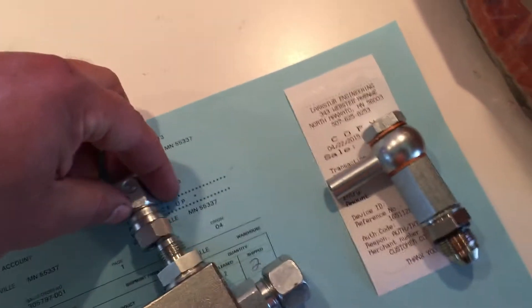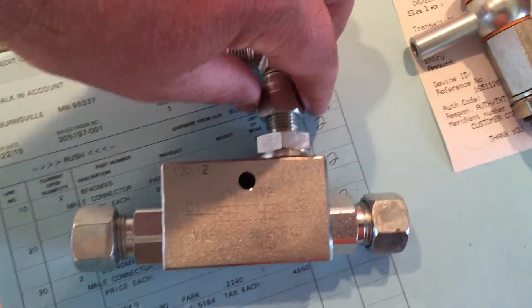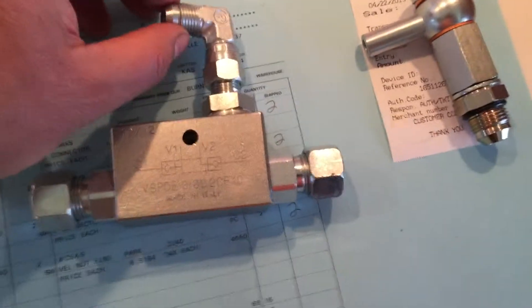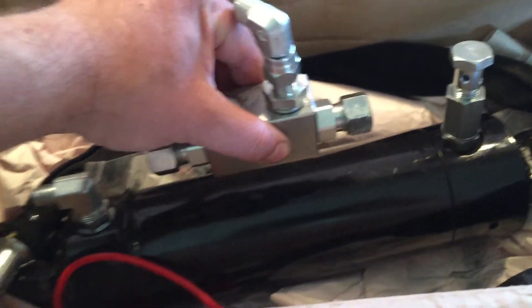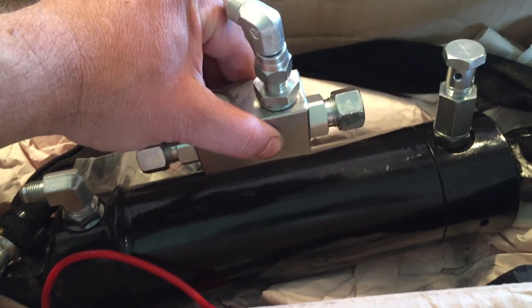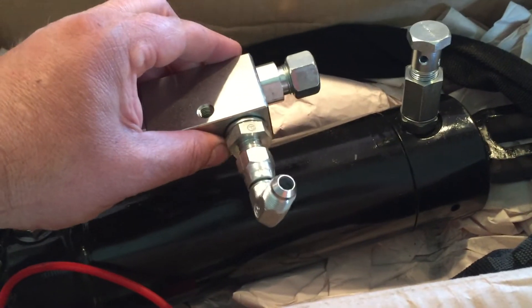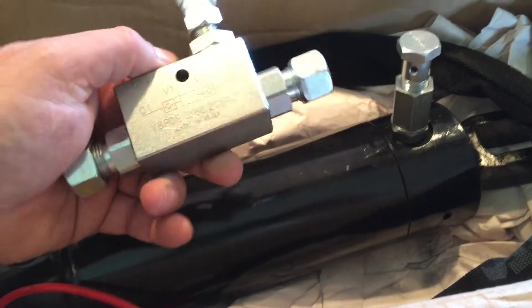Because I don't have the tractor with me, I don't know if I'm going to run into a clearance problem. I also got 90-degree fittings, so if I need them I'll be able to shoot the hoses straight out. The right is the bottom and the left is the top on this cylinder, and technically I've got all kinds of space so I can rotate this entire assembly side to side if need be.